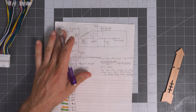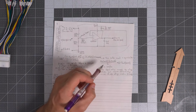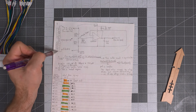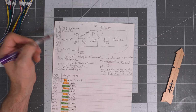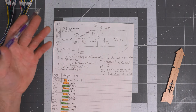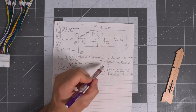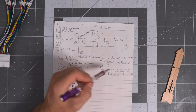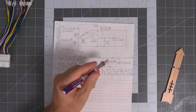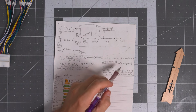Sorry, I'm in an absolute versus a relative frame here. This is absolute voltage. So this would be 0 volts or wherever we are in the pack, 100 volts, and then this would be 118 volts, and this would be 136, just theoretically. In absolute frame reference, this is correct. It would be that voltage: 136 minus 100 volts is 36 volts, divided by 2 is 18. So if this were relative, then you would want to add those, which is interesting.